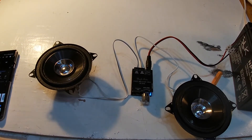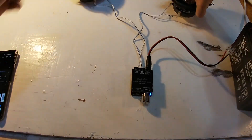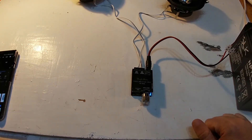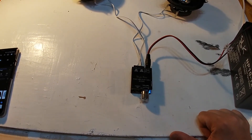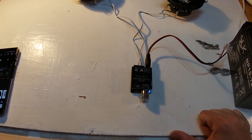You can see the speakers moving — they are quite loud at only about 50 percent volume. There's a little bit of distortion, but that's actually from the speakers because they're not in an enclosure at the moment. It's nice and loud, and this is only running at 12 volts. If you took it to 24 volts it would go louder, but most applications I'd see would be running at 12 volts anyway.